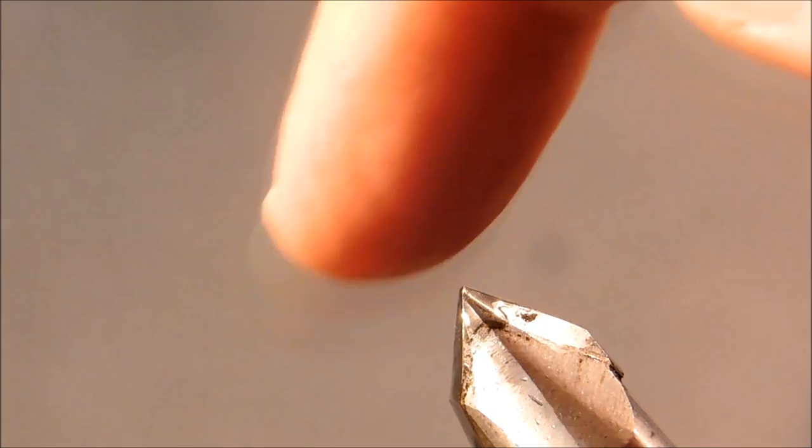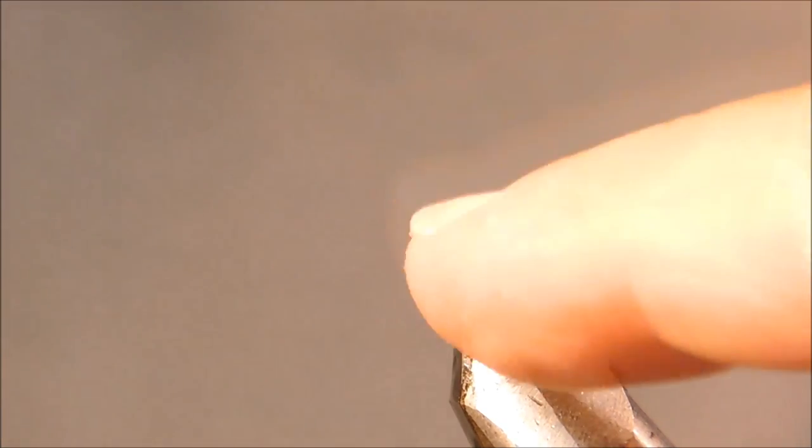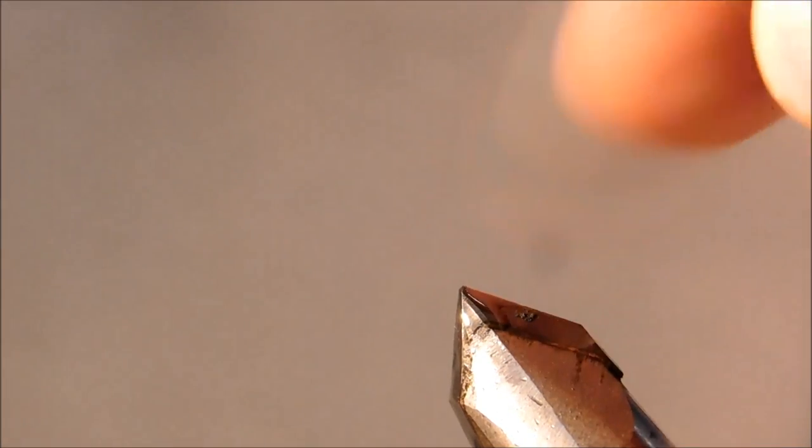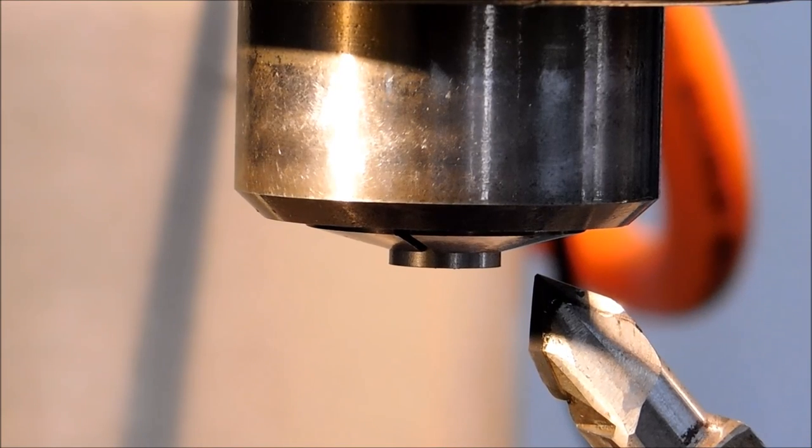Load the other part, the short part in, with the countersink up in the collet. Okay, so you want the parted side down. Do the same thing with the short side. Short piece. When you decide to face off the short slug that you parted off previously, make sure that you engage as much of it as you can in your collet to assure that it's running true.